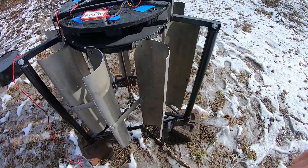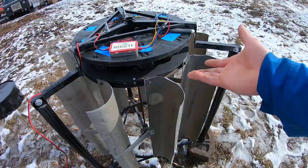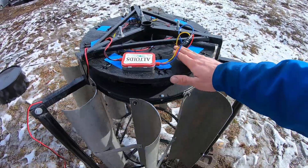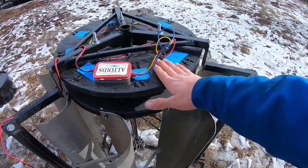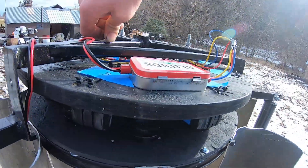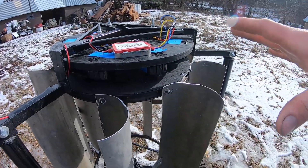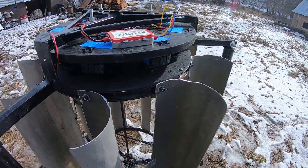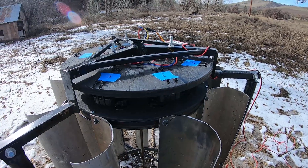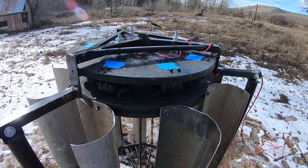So all of that was a lot to follow, but essentially what we're doing is spinning a turbine with a platform with 12 magnets on it, oriented north-south, north-south, north-south repeating. We've got a platform that stands over the top with coils on it that are adjustable with three bolts. We want to make sure it's adjustable so we can dial in the coils as close as we can to the magnets, because the closer you are, the more influence the magnets are going to have and the more power you're going to make. I'm going to give it a spin, break out the multimeter, and show you what kind of output it produces.